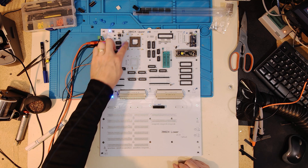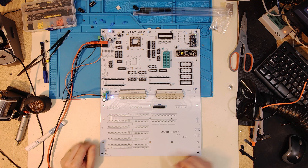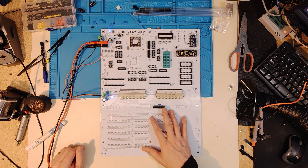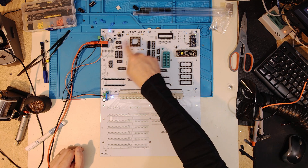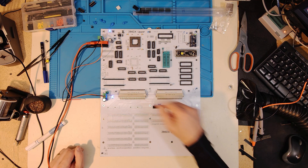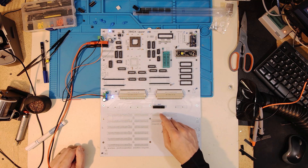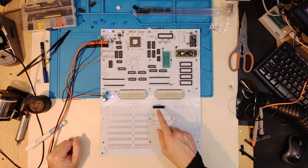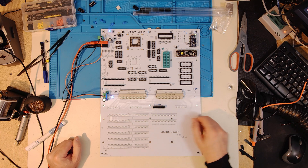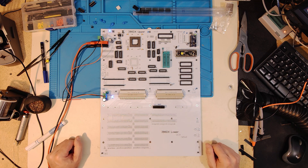So that's where I'm going to stop this video. In the next video I'm probably going to detach the bottom board and try to get in the basic components to see if I'm getting address information coming out of this processor that looks reasonable. Maybe even before that I want to get one of these add-in cards to read these signals and send it to a debugger on my PC, so I can log what addresses I'm seeing as I turn this on. But so far this was just a lot of soldering work - nothing exciting in this video other than solder, solder, and more solder.